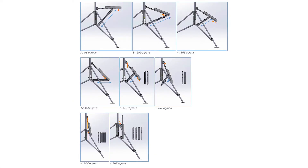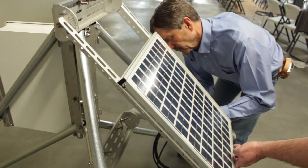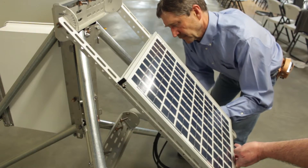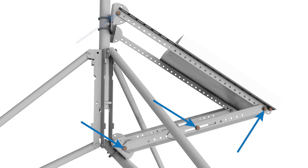These illustrations, found on the extended bracket's installation guide, show the correct positioning for the solar panel. Note that for some angles, one or more extension brackets indicated by the blue arrows will have to be removed from the bracket. Once the correct angle has been set, tighten all the remaining loose hardware on the extended bracket indicated by the blue arrows.